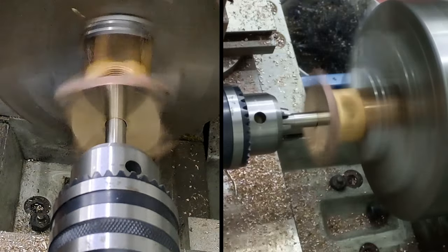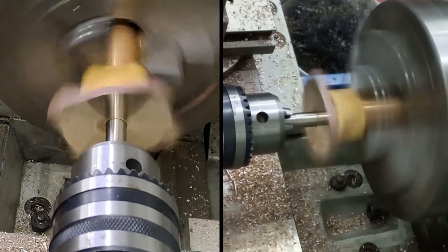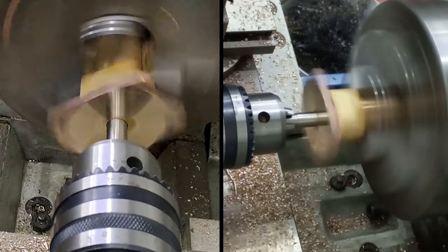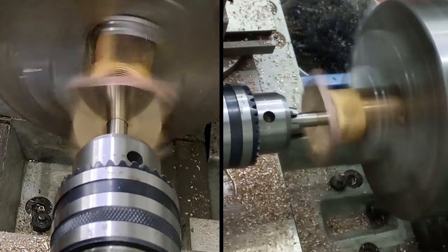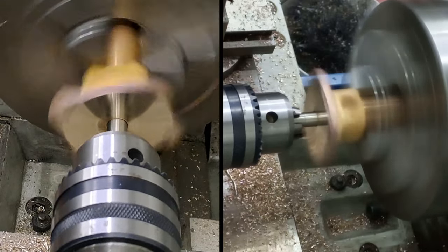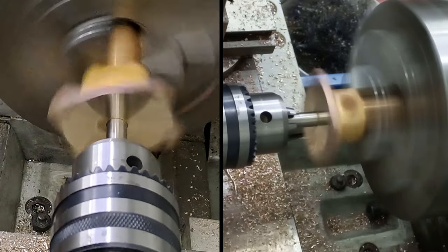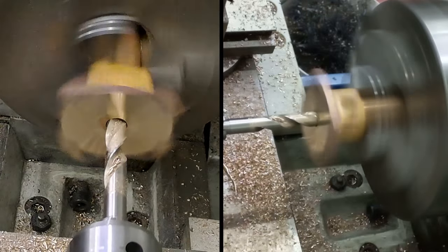Right, now we're down to as far as the last drill went. Yeah, I can see chips in the valve box. Squeeze that squeak, that's the tailstock. We're hitting those slots again. So an interrupted cut basically with a drill. I'm going to have to move the tailstock up a third time, so I can get as much depth as I can.